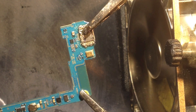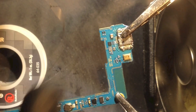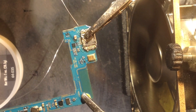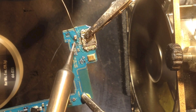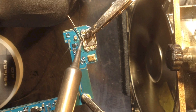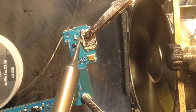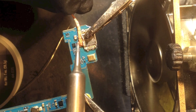What I did first is solder on the four main points that go through the board on the other side — that's already done, so the port is firmly in place. Now I'm about ready to do the seven contact points. You just put a really small amount of solder down, work it from one side to the other, and try to drop a little bit onto each point. You really want to count on the flux to float that solder the right way so it's only bonding to the adhesion points.